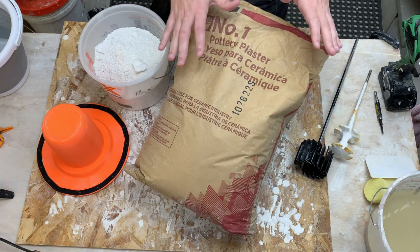These plasters have been specifically designed so that they suck the water out of the slip. Water is then absorbed into the plaster and transmitted to the outside - it's part of the magic behind how slip casting works. So that's the right thing to do in terms of getting the plaster.